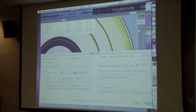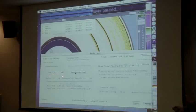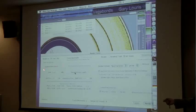But in this case, we have a special case because we have the advantage of the RIAA curve in the digital domain. And you remember I said we have an extra 2 bits or 12 dB of dynamic range. So if we add 6 dB of gain, it's within that window and we don't care. It's going to preserve all the information in the recording. All the internal calculations are done with 64 bits of precision. So there's no distortion added to the recording during this process. And of course, because we're doing the RIAA curve in the digital domain, that operation in itself is distortion free.